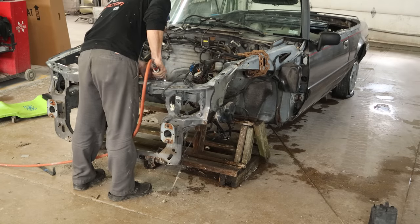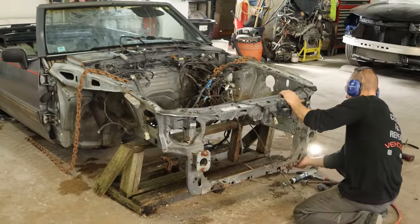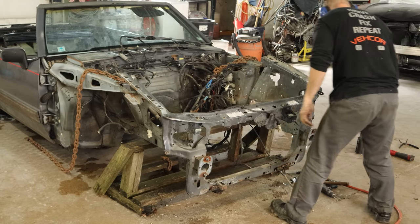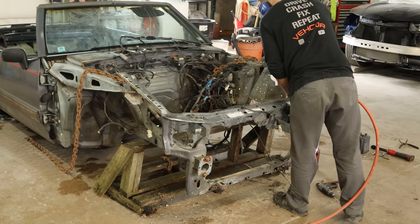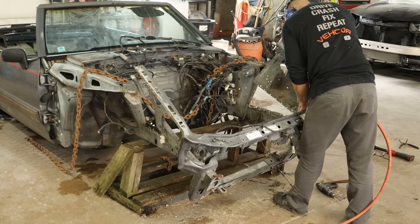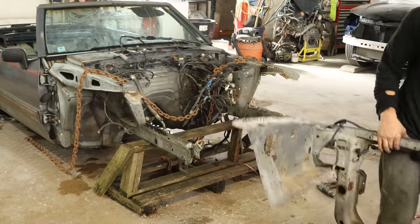I know, I know — wrong hammer. It's also the wrong breaker, so two wrongs make it right. If you need the right breaker for the job, head over to my Amazon store — you can also pick up the wrong one, which is my five-in-one painter's tool; it works just as well. Work our way around and pop it all loose — doesn't take much. We can't get our breaker in for the bottom, so we're going to use our air chisel with a big flat tip and just hit the rail itself; the vibration will break ninety percent of those welds loose, and whatever it doesn't, we're just going to wiggle it off. There's one that just won't stop fighting us, so we'll actually cut that one off — it was the little flange at the bottom.